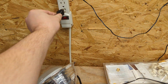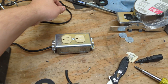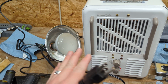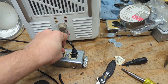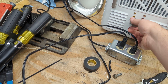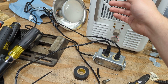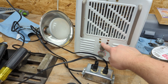Now I'm going to show you how this works. Let's plug this in. There's your handy little box and we're going to connect our top outlet to a light. Turn it on — nothing happens. Let's grab something to plug in. Obviously a 16-gauge lead shouldn't run a space heater, but we're going to run everything through a 65-watt light bulb. Everything going through has to pass through the light bulb first and then the space heater. I put it on 1500 watts — the bulb is lit. The fan is able to run, but there's no actual heat coming out. The light is very dim.